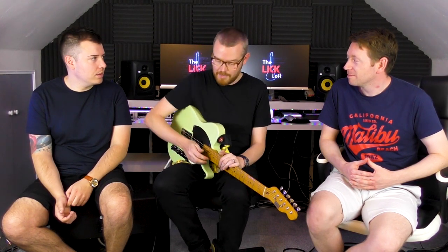So those are actually the first people to hear about that. Can you tell us briefly what it could be? That's going to be your full range transparent. I want it louder. Everything louder. It's going to be called the Pumper because it's going to have voltage doubling inside, a voltage pump. So it's going to be producing 18 volts, loads of headroom, and you're going to have more volume. I'm not going to fit this on. Yeah, exactly. High and low cuts on that as well, so you can also tame the top and the bottom if you're using it pre-gain or something, so you're not just slamming all the frequencies.